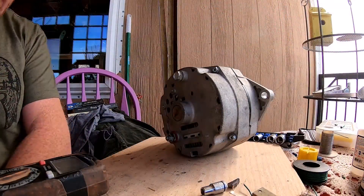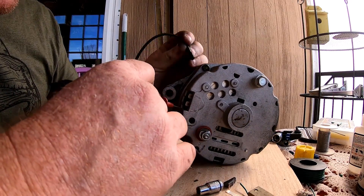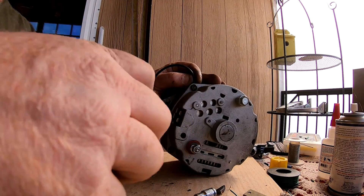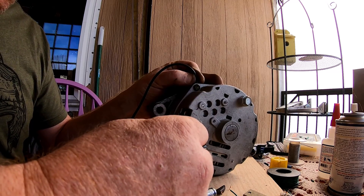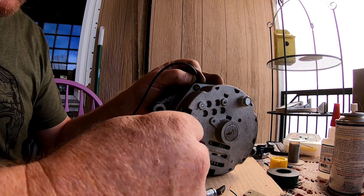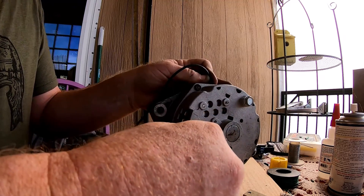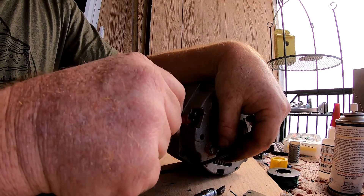When you test this thing, you want to make sure you have continuity between ground right here against the case. Through here it goes through the coil — I'm getting about 8.3 ohms. This one's just an open circuit — there's no ohms on my meter. You don't want any continuity at all between here and here, or here and here — you want no continuity between those two points either.